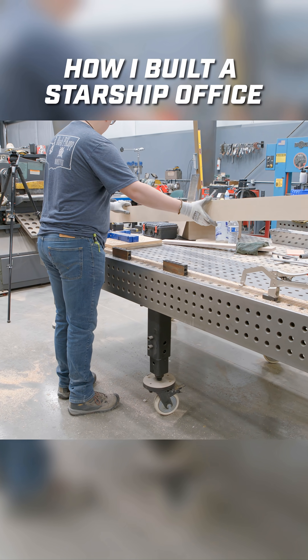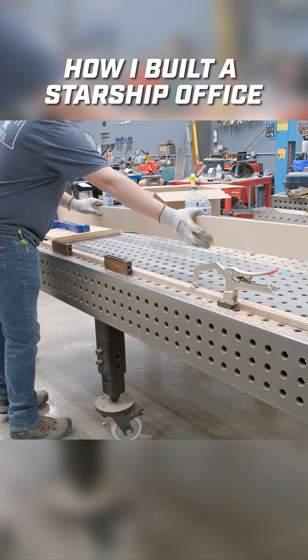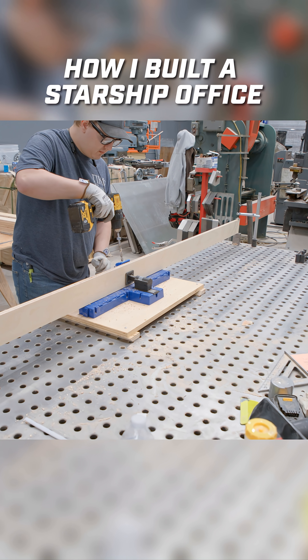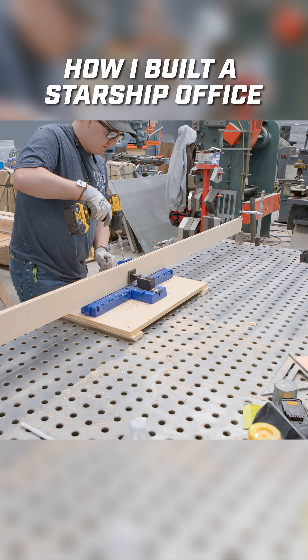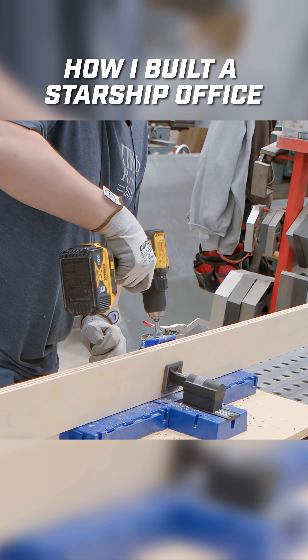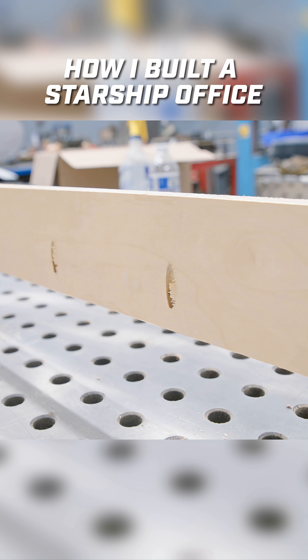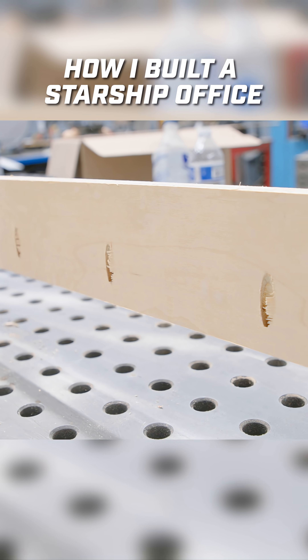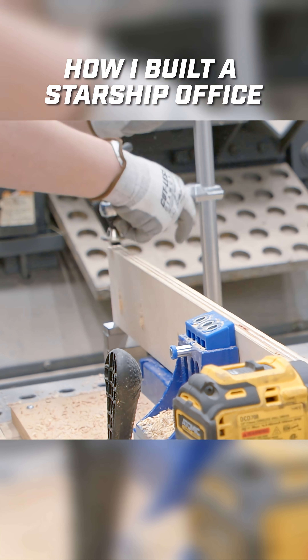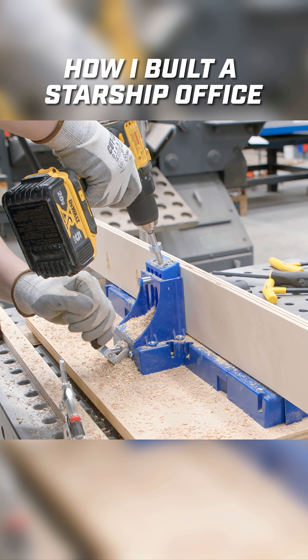Because our shutter boxes are going to be exposed edges, we need to find some way to fasten them securely to the side of the building. The drill bit we're using is a specialty bit specifically for cutting pocket holes that creates a square shoulder on an angle inside of the board. Since I have about 800 holes to drill, I figured the best way to do this will be to set up a jig — specifically one made by Kreg for putting in pocket holes.